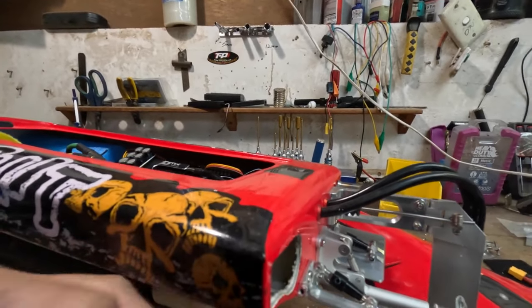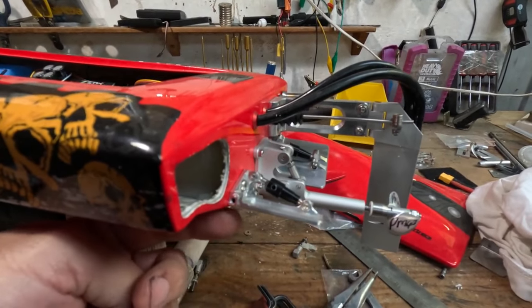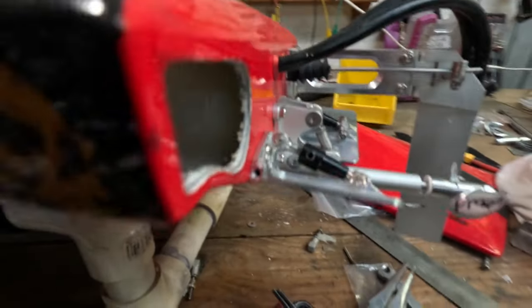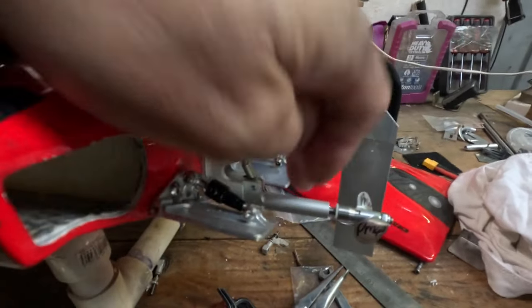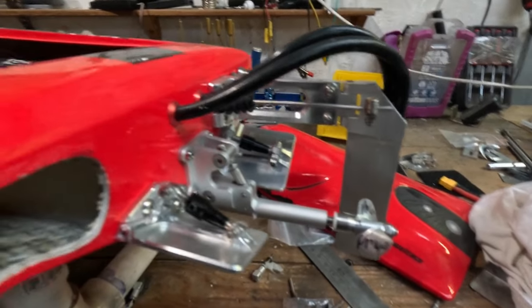Just to show people — I've actually got them set about the same as what I had the smaller tabs on. So just down maybe a millimetre below the bottom of the hull, just angled down just a touch. Stinger is on dead level if I remember right. So let's see what that does.